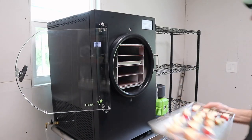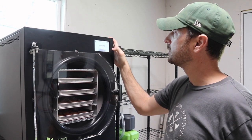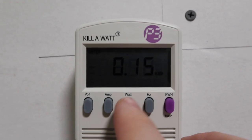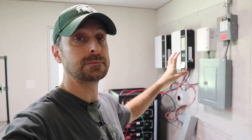We're opening it up, loading our apples, and hitting continue to go into the freezing cycle. Our kilowatt hours jumped slightly to 0.15 — wattage and amps are about the same. There really isn't much draw at all during these initial steps, which could take three to six hours. When planning to run this on your system, be aware of the wattage, usage, and times on all cycles, and consider the other loads you're using in your house if you have a smaller or medium-sized system like I do.